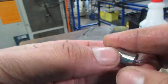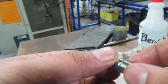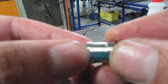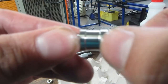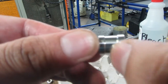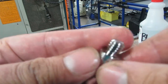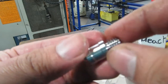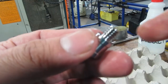So this is the first operation. When we go to mill it, we'll mill the hex in the center here. So there's no deburr - there's two chamfers. There are two chamfers in the middle here. You see that little undercut? So there should be no deburr in this once it's all done, which is pretty cool. This is the back of the 30-06 pins - we'll come back when it's the mill time.